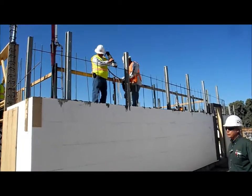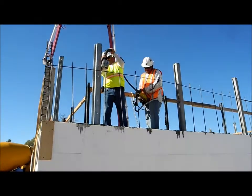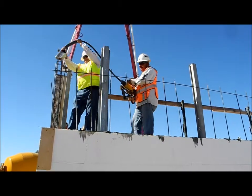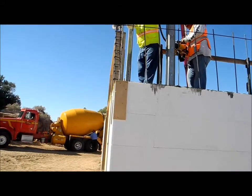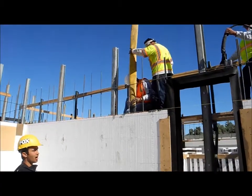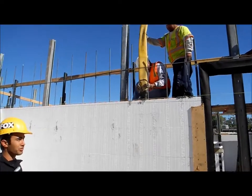It's great for these four-inch forms because it's hard to get a vibrator down these walls with all the rebar grids in there. You just put it on the top and let it shake for about ten seconds, and we got great consolidation. This is Joey with Forming Solutions Distribution — these guys are topping off right now, and it just can't go any faster than that.